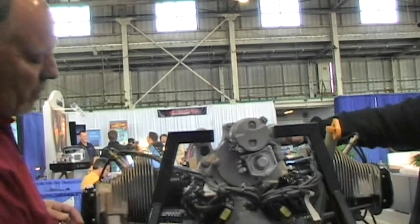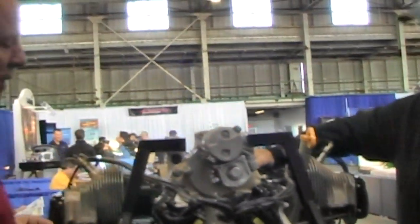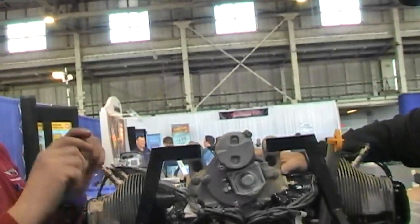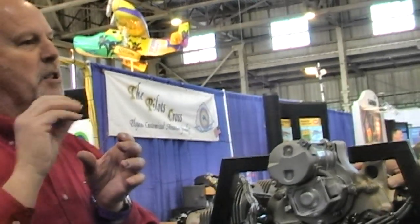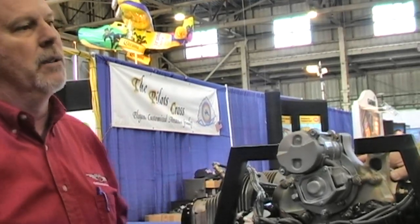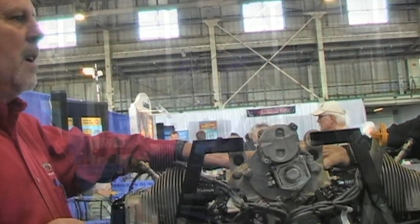The sump is one thing we didn't really talk about — this is an aluminum fabricated sump. We're all familiar with the old steel kidneys, and that was an area where we saved more weight. Starting with ounces and then pounds, even accessory covers were addressed. The block-off plate is a piece of machined billet that's much thinner, with strength ribs machined in lighter. That's ultimately where the weight reduction had to stop to keep the durability and reliability we've had for years.